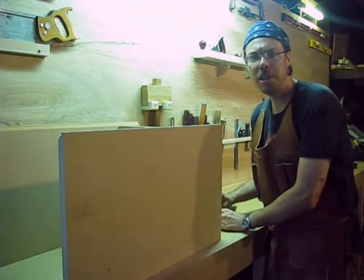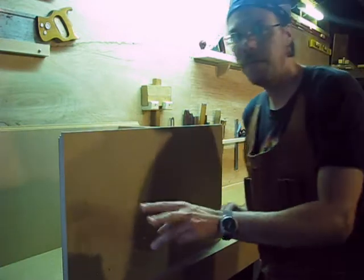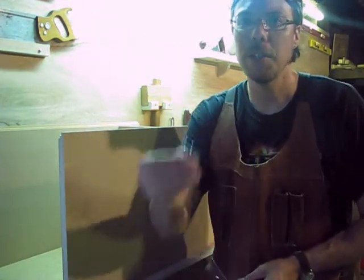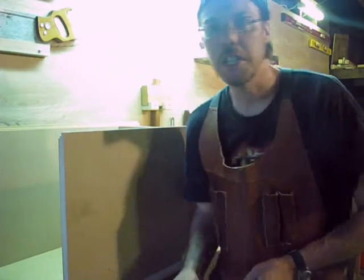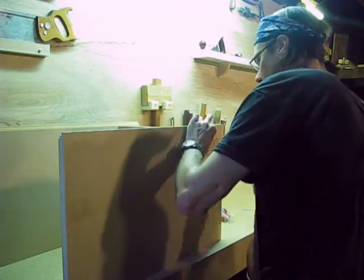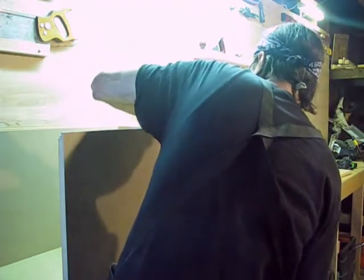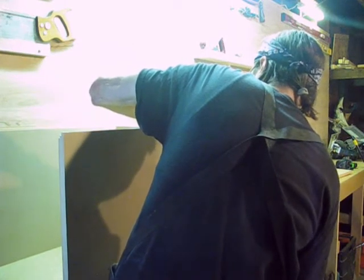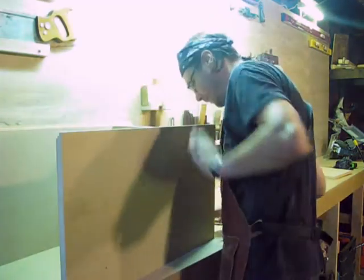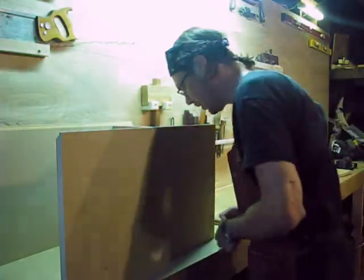Most pros would use a narrow crown stapler to finish this off. Even on finished woods, you can line them up with the grain and they're pretty invisible. I don't have one of those, so I'm just using finish nails. About 3 per side is plenty. And this is a painted cabinet anyway, so we can spackle those holes and they will be utterly invisible. Trying to get away from me.